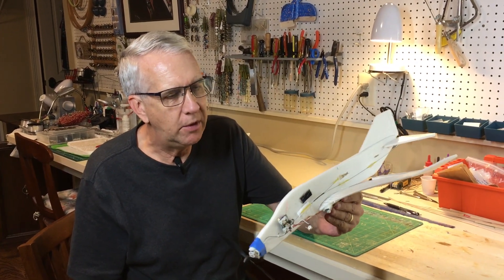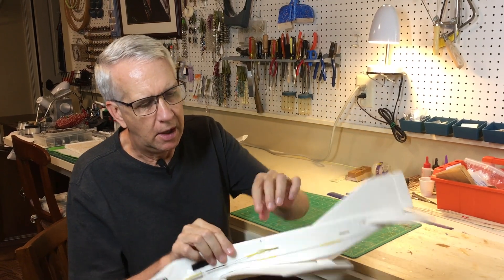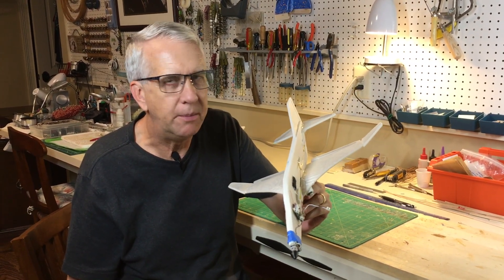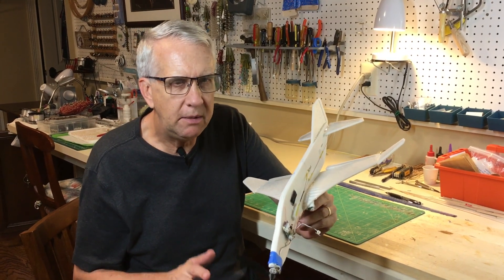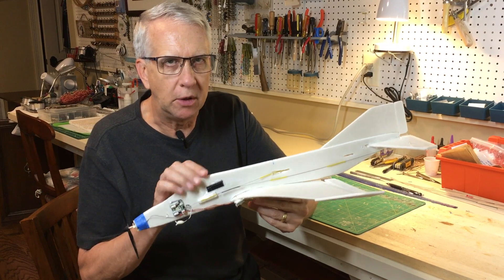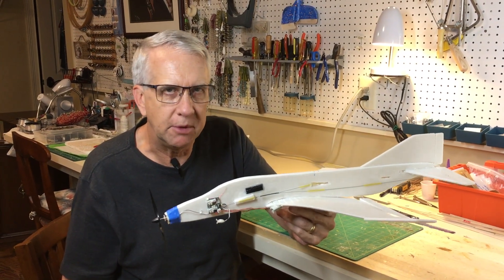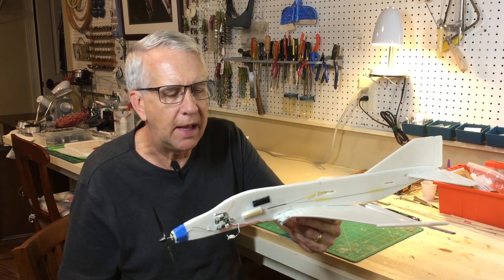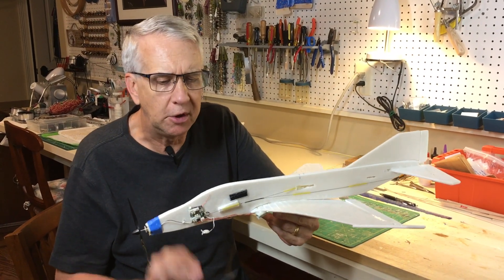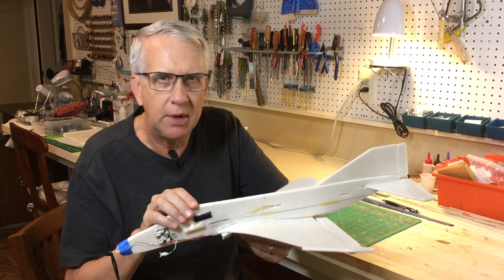So what I think happened was: even though the plane came in at 2.2 ounces — and I had to put in two washers at the back to balance it at the correct CG — due to the swept wing, it has to fly quite a bit faster than the straight-wing models to fly properly. The planes flew okay and were somewhat controllable, but just underpowered. The good news is with foam board construction you can build it quick — I built this entire airplane in a day. The search will go on for a higher power source. The plane will just need to fly faster with a bigger engine, and we'll need to fly it out in a field. It was a good learning experience going from the plans to building the airplane. 2.2 ounces with this motor — not enough for the swept wing. We'll see what happens next. Thanks for watching.